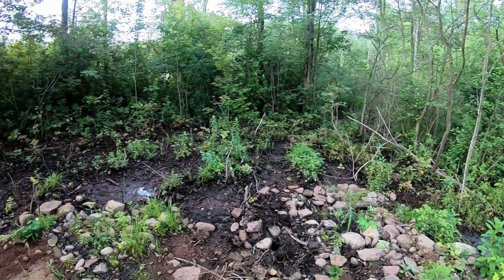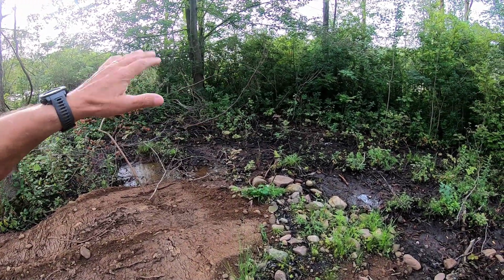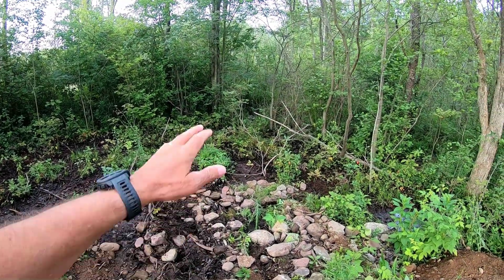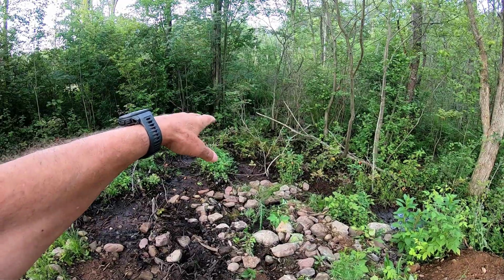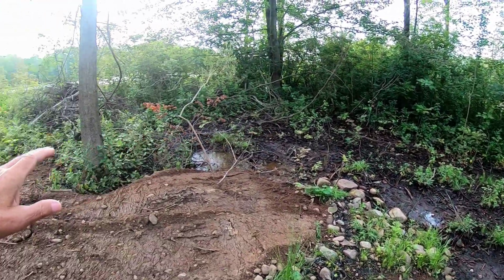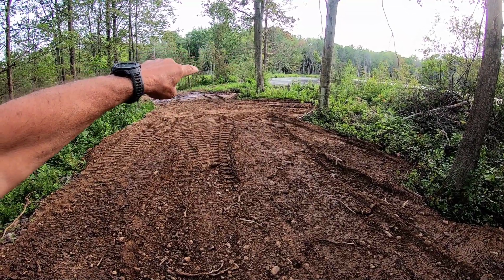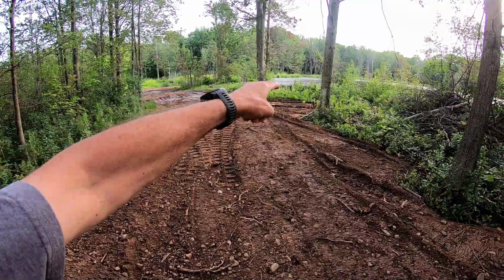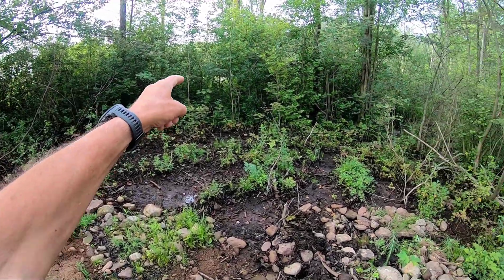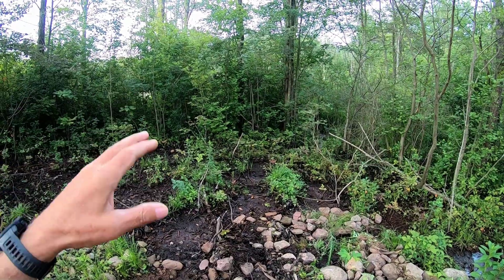So the water spills through the beaver dam all around in this area here, and it's a real thick area, and I want to leave as much of the thick stuff as possible as I find my way through. But I have to put 3, probably 4 and 5 foot of stone down in this area and then put gravel on it as I work around, because the beaver pond has these areas that extend out further along the roadway there, and then there's almost like a peninsula here, and then the beaver pond dives deeper into this area behind all the brush and trees that's difficult to see.